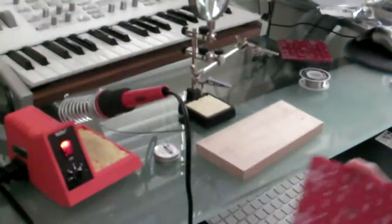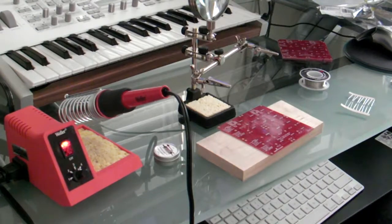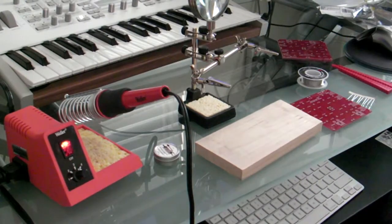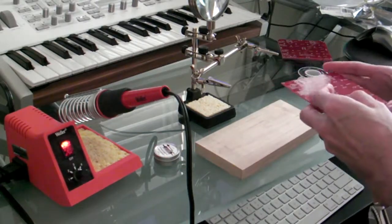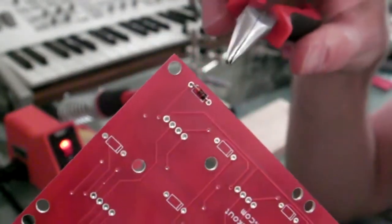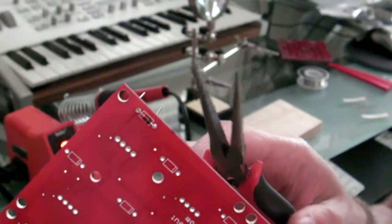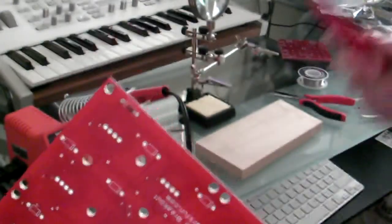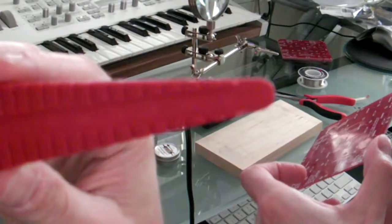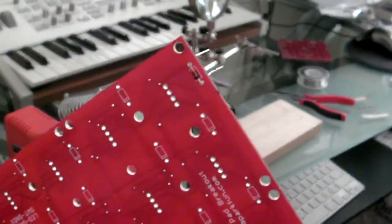That's what I'm working off of right now, but I just went for the soldering iron to heat up, and then we'll go from there. As it turns out, these diodes are really pretty tight-fitting. I found the easiest way to get them fitted in is to take a pair of needle-nose pliers and just twist the ends as close as you can. Usually when I'm fitting components, I have a tool for bending them to the right proportion, but even the smallest option on there wasn't small enough to work for these diodes, so I'm just going to bend them all manually and slot them in.